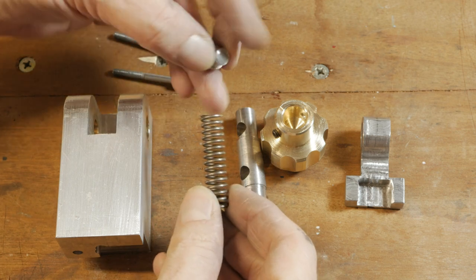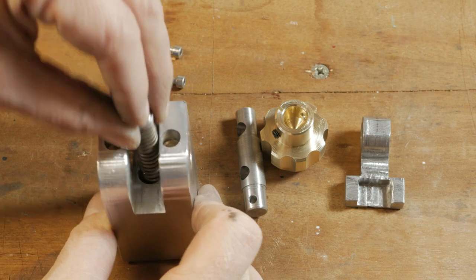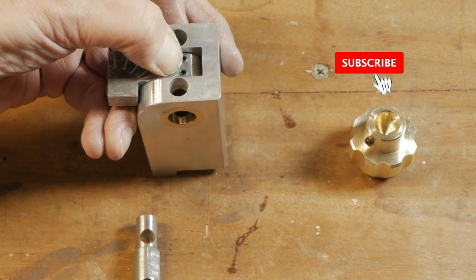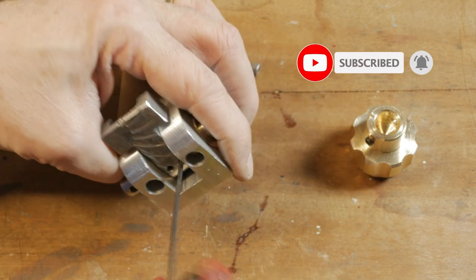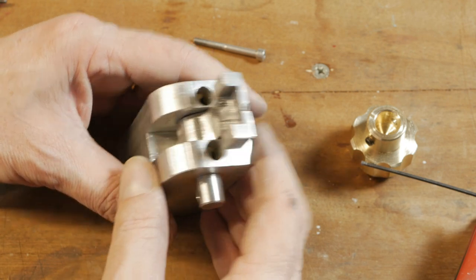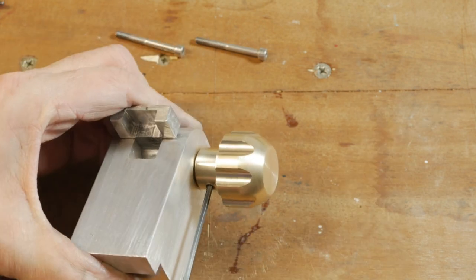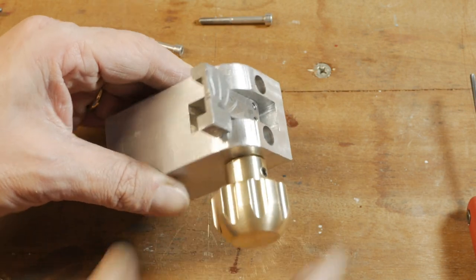The final assembly shows how convenient the screws hidden inside the aluminium block are, also because I have no possibility of fixing them externally. The spring has been shortened 2 times. I try to make it as hard as possible, but not too much, otherwise I would no longer have been able to mount the central shaft.